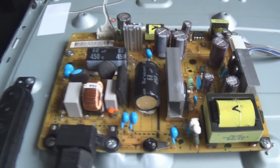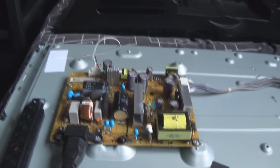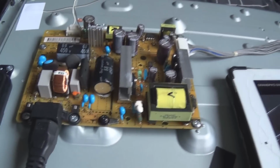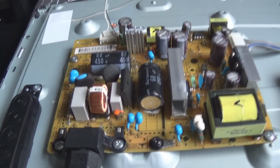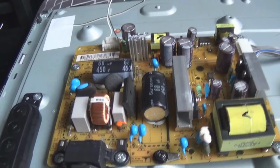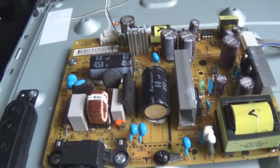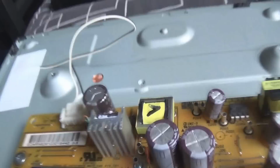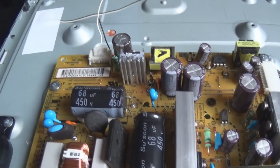So I was checking out the power supply, and I was finding that the LED MOSFETs, which I'm going to show in a second, weren't being turned on enough. They weren't receiving a VCC voltage, which is the voltage that tells the MOSFETs to drive and create the boosted voltage for the LED strings. It's a bit like a DC converter. They use this little buffer transformer to create the 70 volts from the 24 volt rail on the power supply.